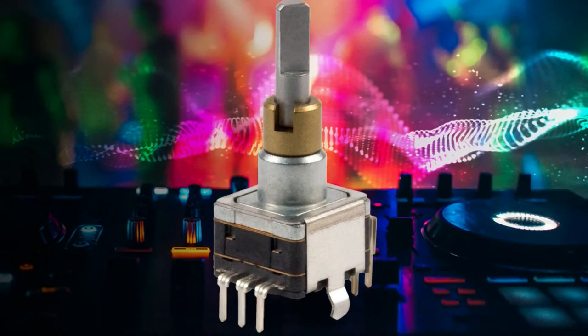So you can see there's the shaft, that's one encoder, and then the brassy thing is a second encoder. And then you can also press it, there's a detent button inside. I will say that you do need a custom knob for this, because you want the outer ring to latch onto that little divot. In the brass knob there's a little slot, or sorry, two slots, one on each side, and you want whatever knob you design to slot into that so you can have both rotate separately. This doesn't come with a knob, but if you're designing this into your product, chances are you're going to do injection molding anyways. So I thought I'd show a quick demo, and then we would show that it's in stock.